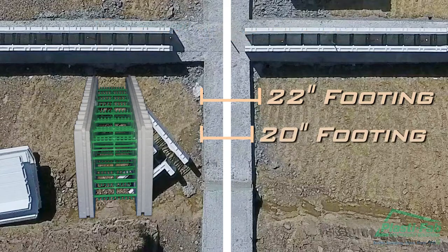A 20-inch or 22-inch wide footing makes it more practical to lay all blocks in case errors in alignment have occurred. Always consult local codes to make sure the footing will accommodate the Advantage ICF System Foundation.